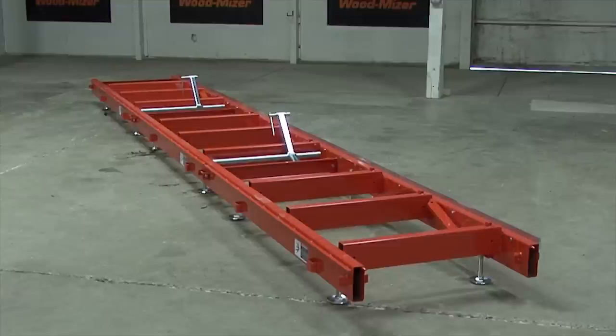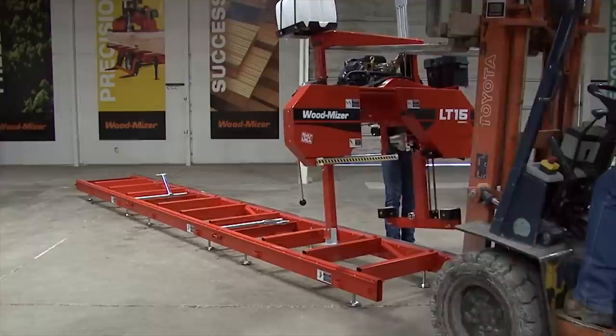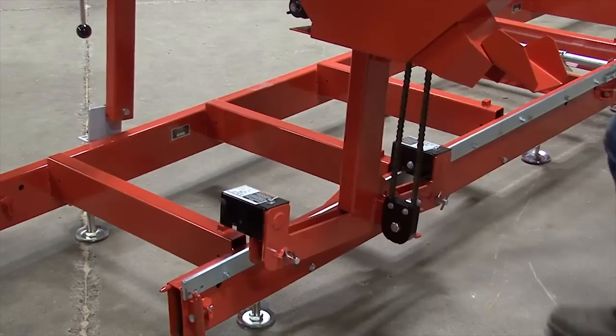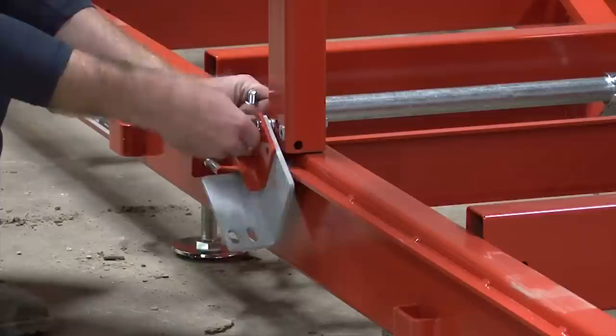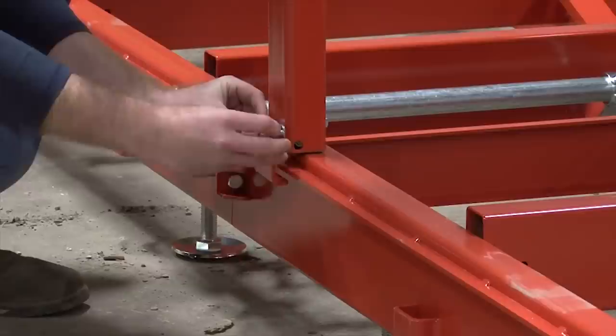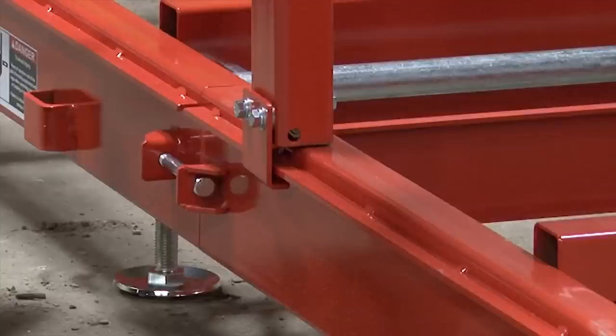Next, install the head assembly onto the bed assembly. Lift and align the head assembly over the bed. The two locking pins will need to be pulled out to let the head assembly go down against the main bed rail. Once in place, remove the lower mast retaining bracket and shipping bracket from its packing position. Using the same hex head bolts and flat washers, reinstall the lower mast retaining bracket as shown. This bracket serves to secure the mast to the outer rail of the saw bed and should not actually contact the bed at any point.